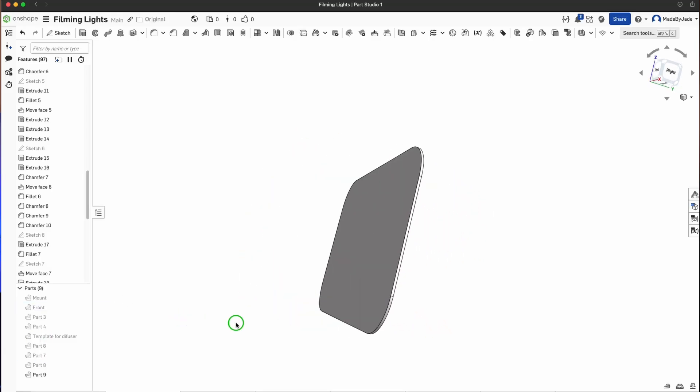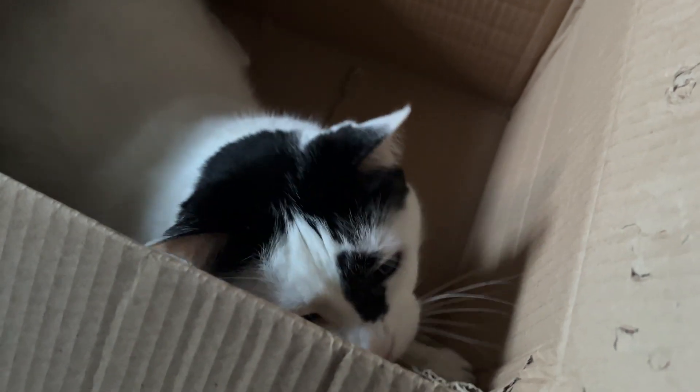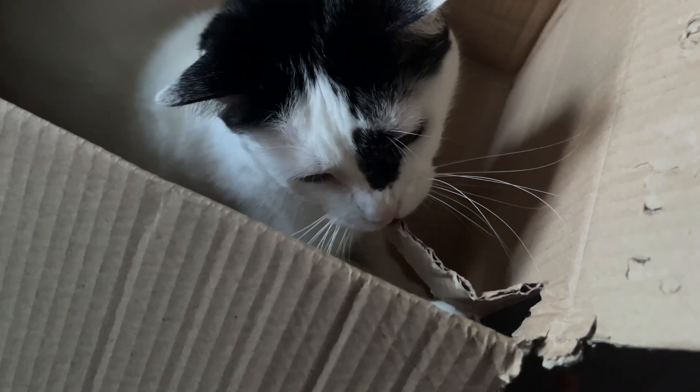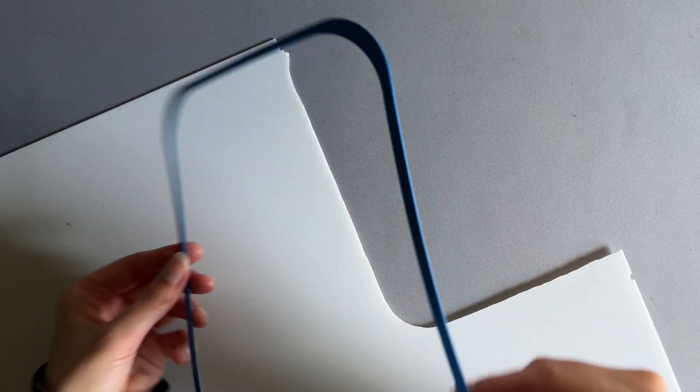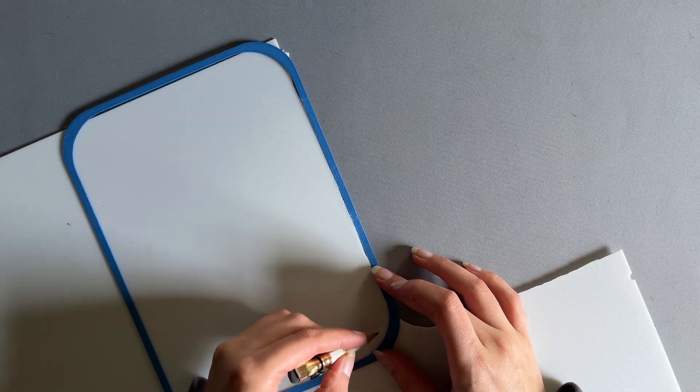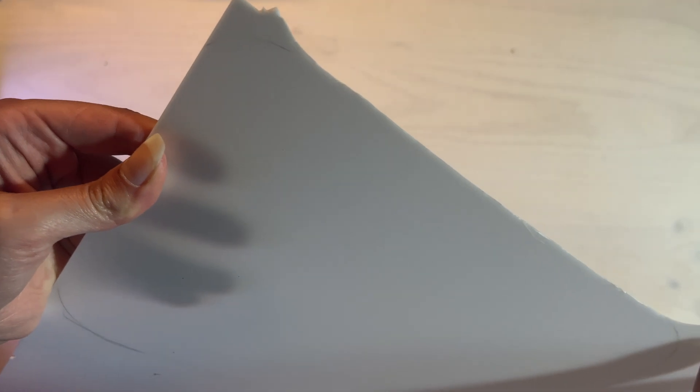For the diffuser, I could have printed it super thin in white filament, but recently my TV broke — I don't know what happened, it might have been a cat. I decided to repurpose the parts I could, and this was a perfect opportunity to use the LED diffuser from the TV. I printed a template for the diffuser — super thin, just 4 layers was enough — traced the shape on the diffuser and cut it. It was incredibly hard to cut the thicker layer by hand. I used an X-Acto knife — probably not the best thing, but any other method would just break it. A few hours later I had a diffuser.